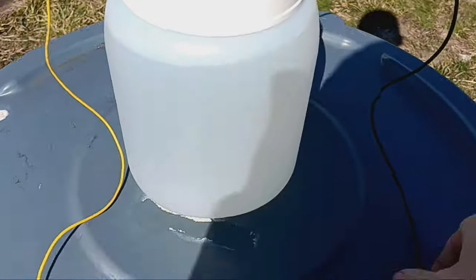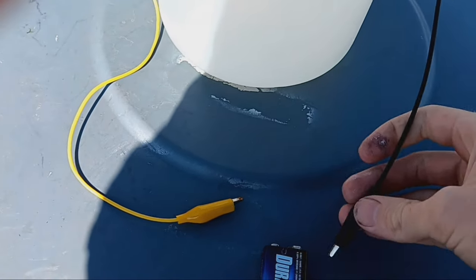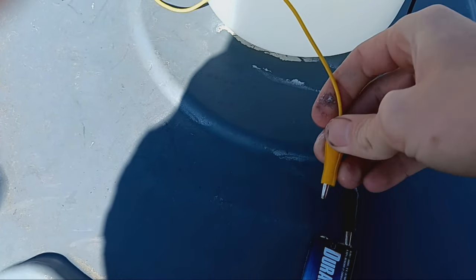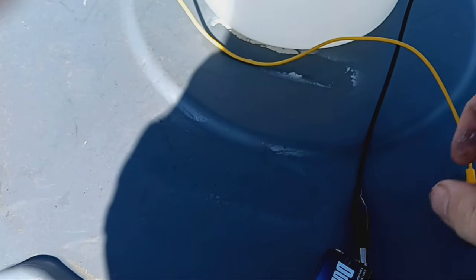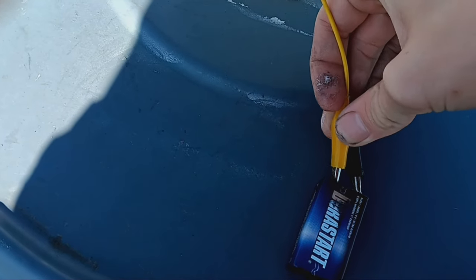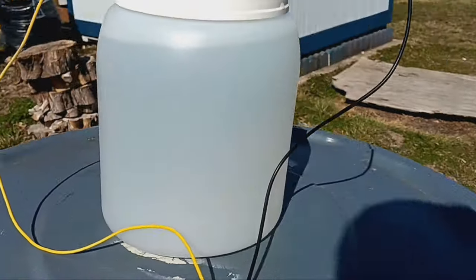The cell is working, but the iron bolt is not oxidizing, which is good — that means I've done things right. This is probably why steel can be the cathode material, because you're attracting cations instead of anions. The problem is that hydrogen will go into the steel and make it really weak — that's why steel is somewhat bad, but there's no alternative for this process.